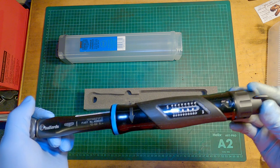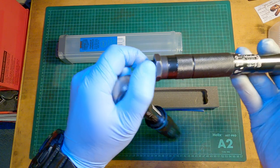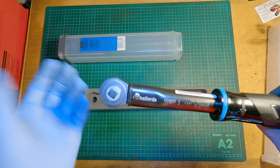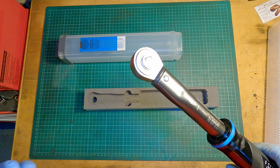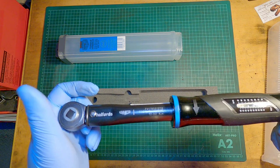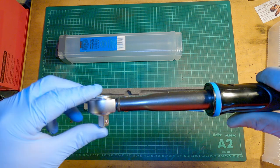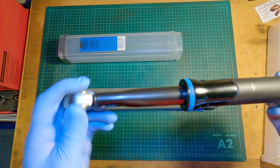Some of the features: the easy adjustment, the very nice locking — compared to the old one where you had to unscrew it to unlock it. Also, you can only use this to tighten things to torque, but if you want to use it on left-hand threads or to undo things — for instance if you want to take out glow plugs and don't want to break them, you set a certain torque so you don't put too much force on them — you just flip it over, the arrow is on the other side, and push the square through. So the square goes either way, meaning you can use this to tighten things, undo things, or tighten left-hand threads, which is very good.